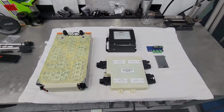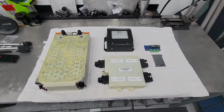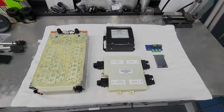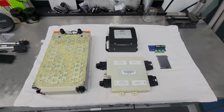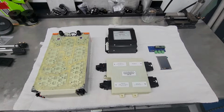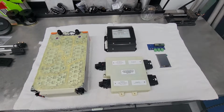So I thought I'd make a little overview of the core components of the 48 volt system that I've selected to power the e-boosters. All of this is here to power two 48 volt e-boosters. They're, let's say, about 5 to 6 kilowatts peak each. So that's, let's say, 10 to 12 kilowatts peak total.